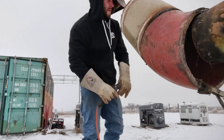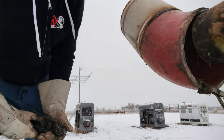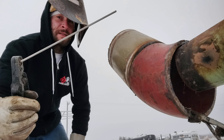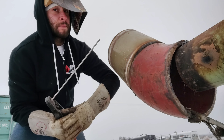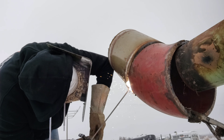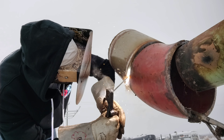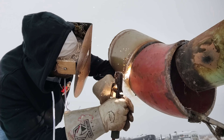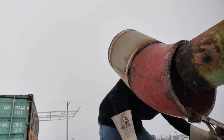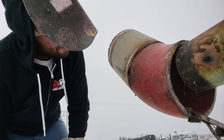125 amps burning beautifully. Not too bad, I like it. Now I always like to bend my rod just a little when I'm going uphill. And I forgot to say — I never switched it to uphill mode, left it in downhill mode. You can do that, but sometimes I suggest putting it in uphill mode just to be safe.